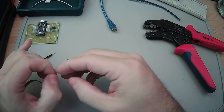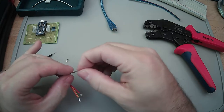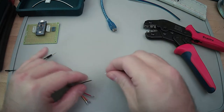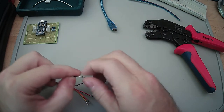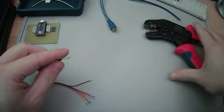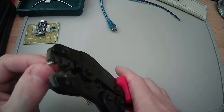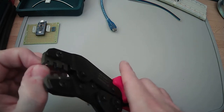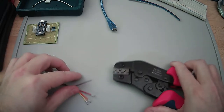Yeah. Because we need to use them for our analog encoders. We use a swerve drive, which is relatively unique, where your wheels can spin independently 360 degrees. But you need to know where in that rotation it is so that your robot goes the right direction. Gotcha.